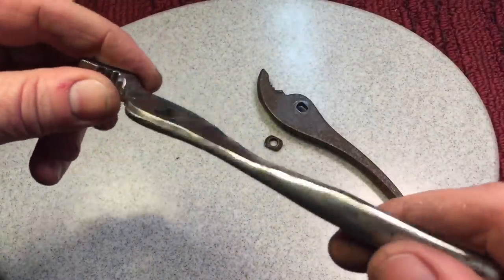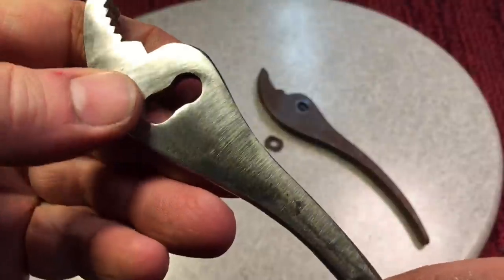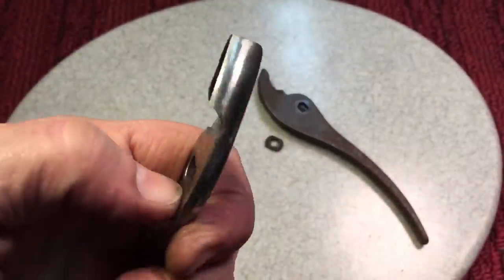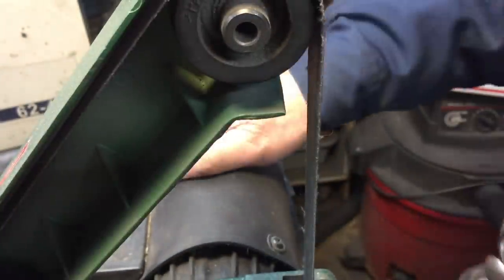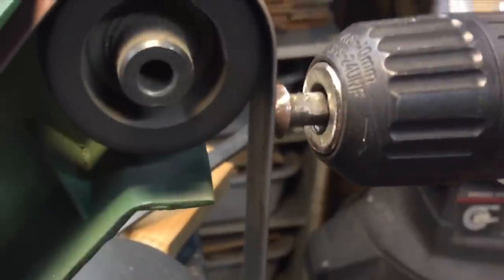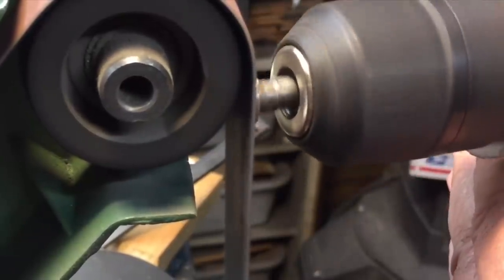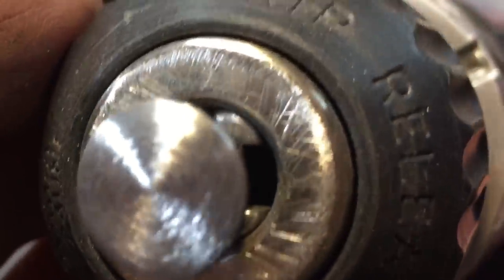This is everything with just the flap sander. Now we're going to go to the belt sander. The flap sander leaves a little here and there, but you can really contour it nicely with the belt sander and get off all those seams. Now for the pivot bolts — look how bad a shape this one is, all pitted after the wire brush. The best and easiest way is to chuck it up into a cordless drill, start with a very coarse belt just under the top wheel so it doesn't slip off, and rotate it left to right to get the whole area. You perform this with three different belts: coarse, medium, then fine. After the coarse belt, you can see we got rid of all the pits and rust.